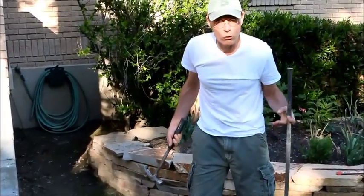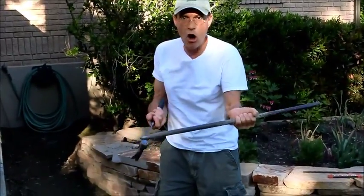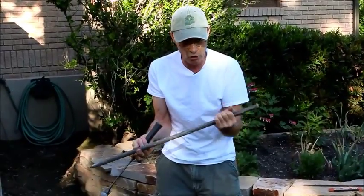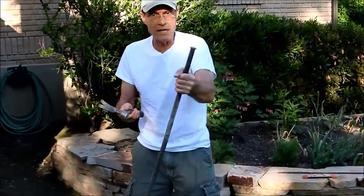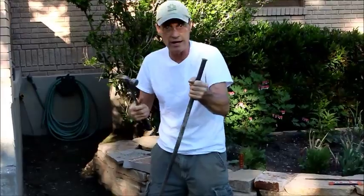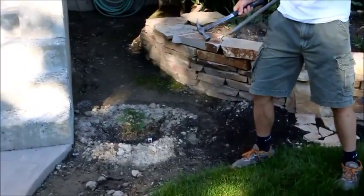If you have really rocky conditions, bigger roots, or more gravel, you can get a concrete stake from your home center — it's a big beefy piece of metal that concrete crews use to set forms for curbs. With a single jack or sledgehammer, you can drive this down through thick roots and rocks, even baby head rocks. It'll break right through — you just pound it down in there for really adverse conditions.